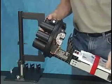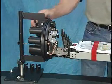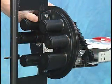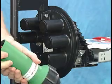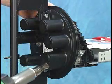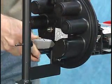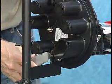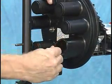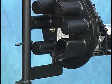To begin the installation, mount the closure in the FOSC400 workstand or similar device. Open the appropriate cable port based on the number of cables to be installed. We recommend preheating the ports slightly to soften the material, then cutting off the end of the ports at the neck-down ridge with a sharp object such as a utility knife or a hacksaw. Remove any burrs or sharp edges from the port to prevent damage to the heat shrink components.